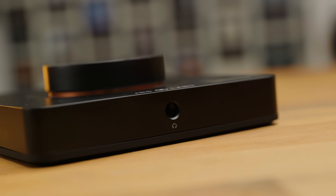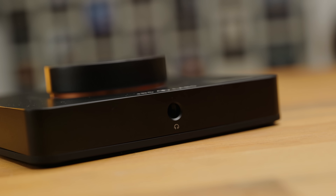And then the second issue — or not really an issue but thing that people might complain about — is that this is a single-ended only device. There are no balanced outputs for the DAC and no balanced outputs for the headphones. But balanced audio mostly really matters when you're needing the noise rejection benefits of XLR going between a DAC and an amp. If you're just going internally in a device like this, which has demonstrably extremely low noise, it doesn't matter. And for headphones, the main benefit of balanced is just that there's more power if you need it — but this has 3 watts into 32 ohms, which is plenty for basically everything.